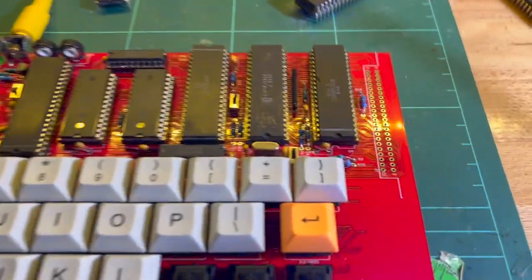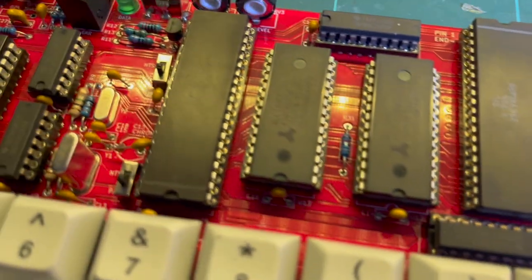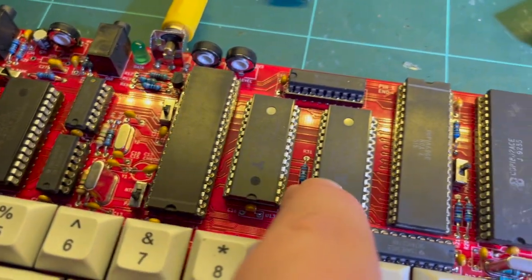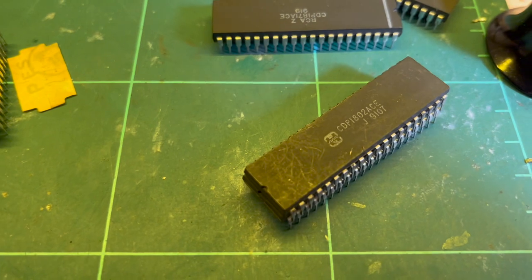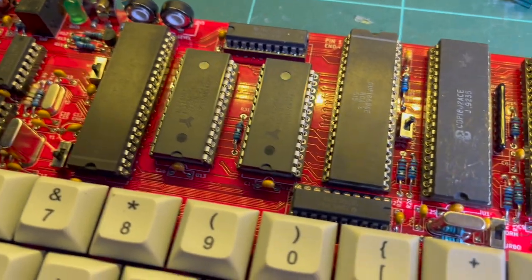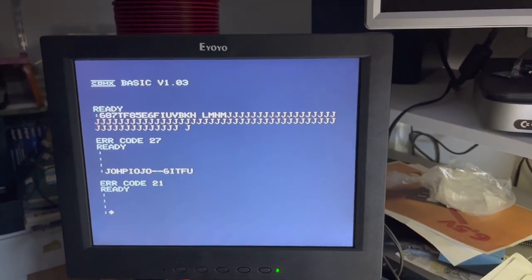So what's the current settings? It's set on PAL. Yeah, I don't know what the final problem was. I've swapped the memory out, so we've got three lots of 32K. I think that must be the screen. Yeah, I'm not sure, but I've swapped it out for what came with the RCA chip set, and then that wasn't working, so I swapped it back in, and now it's working. So I also swapped out the 1802 when it wasn't working, and now it's working. So there we go.